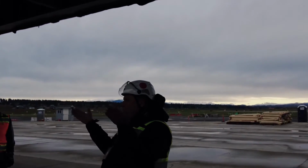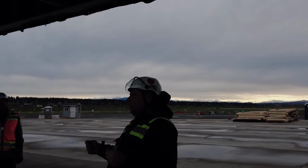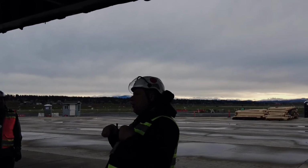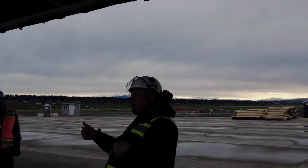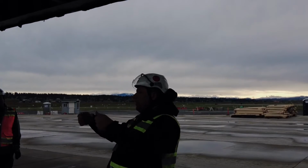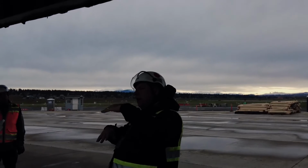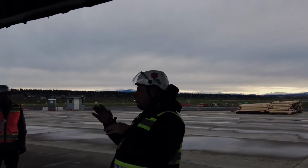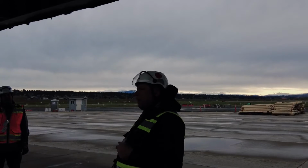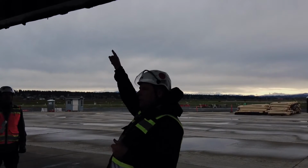There are 342 of those custom circular fixtures. Those have downlights, uplights, and a ring light. To maintain those, you only need access to the penthouse or to the light itself, because you can pull out the up and down light without taking the fixture down. You can just swap it out. So for that type of thing you don't need to get above the lattice. It's really only if you have to get to a J box.